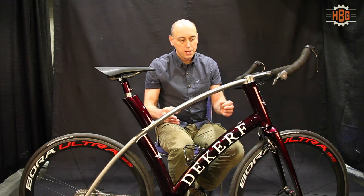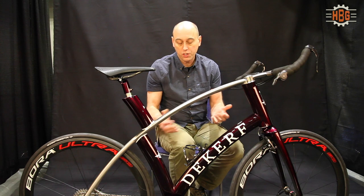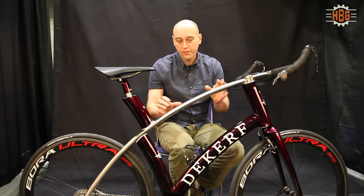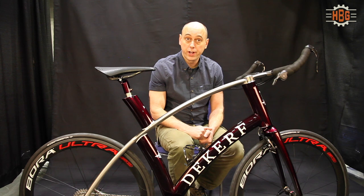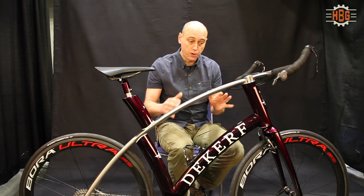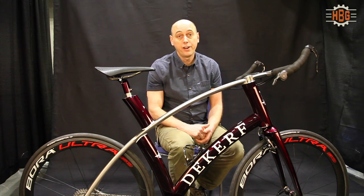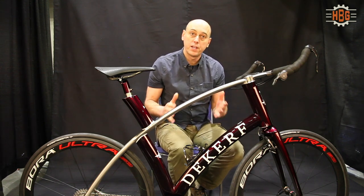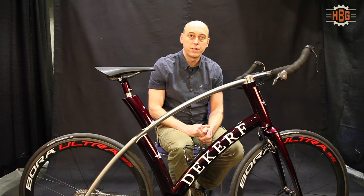All of these tubes started out straight and round. Being that it's all titanium, titanium doesn't like to have its shape changed. So cold-forming and manipulating these tubes into ovals and curves required a lot of learning on my part. I had some experience with it, but this bike really pushed the boundaries of my abilities and what can be done with cold forming and shaping. That required some equipment purchasing, some equipment I had to make myself, and a lot of trial and error. The process has expanded my skill set, particularly on the cold-working side, and I'll be able to carry those things forward into other bikes in the future.